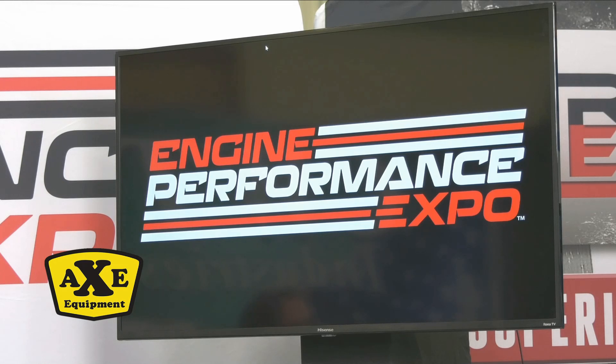You can get them in gas heat or electric heat, single phase or three phase. Another nice feature on these Axe machines is the gear drive. To clean parts, you have to have three things: a good heating system, a good pumping system, and a drive system — a turntable that's turning. What Axe did is put a gear drive back in the corner so your turntable is always going to be rotating. The manifold system that Mr. Axe came up with was very different than anybody else's.